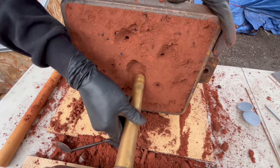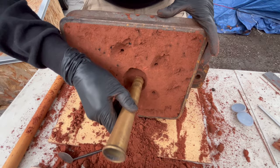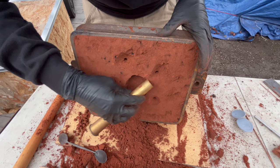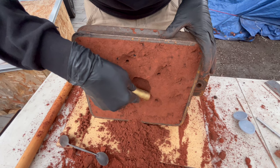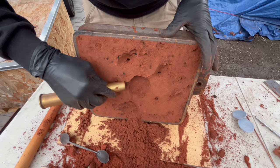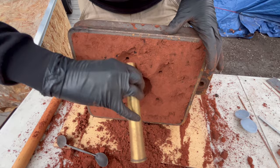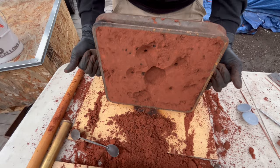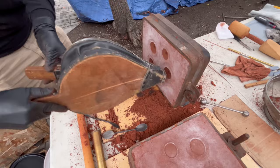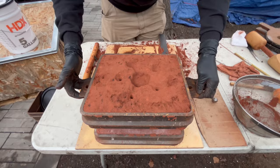Aluminum seems to be really forgiving if you can get enough volume into it, hot enough, with enough feeding hot material. It'll do pretty much whatever you want it to do, is what it seems like to me. If you're too cold or you don't get enough feeding material to it, to where your sprue cools before your part does, then you get all kinds of shrinkage and bad results. But the challenge with this is getting the sand all packed down so it doesn't get picked up in the flow into the mold. Get some real pressure in there. Clean that out. This goes on here.